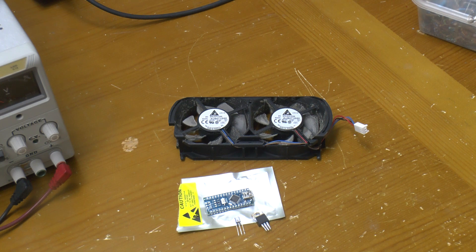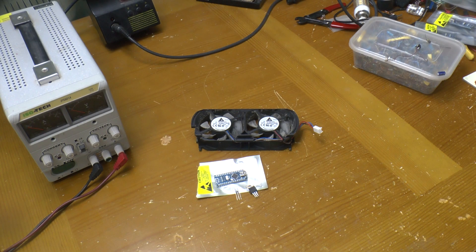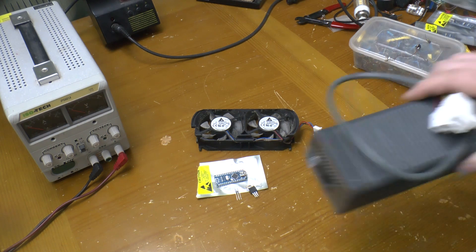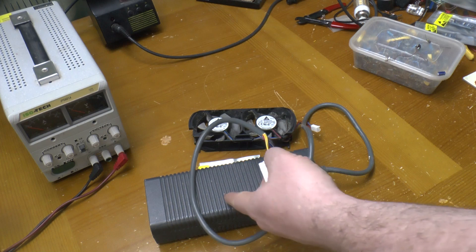There are a few other components I need besides the sensing transistor and the MOSFET. I'm going to add some LEDs to show when the temperature is being detected as rising or falling, and three variable resistors to control the turn-on temperature, the full speed temperature, and the maximum speed of the motor. Add a few current limiting resistors and some connectors and we're hopefully all set. If you want to save a few bob, you can hard code the values for these presets and do away with them — and if you're really tight, you can do it with the LEDs as well. I've already scavenged them from something else, so they're going in. The biggest cost really is the 12 volt power supply, which ought to be something reputable and not some dangerous crap from eBay. I've got some CCTV power supplies that'll do nicely, but I can also repurpose an Xbox power supply, which has a five volt and a very juicy 12 volt output — in this case, 14 amps.